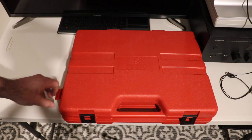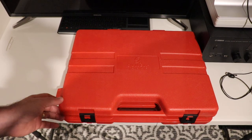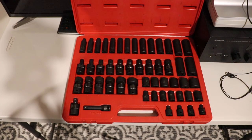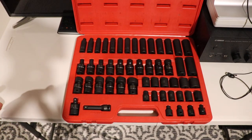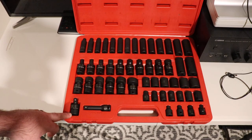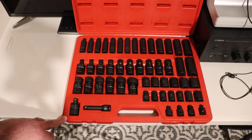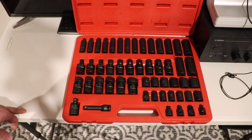I think you'll really like these. I've gotten a lot of good use out of my dual set, but I'm going to be carrying this one around more because it's got a nice wide range — 7 to 22 millimeter. It's all the same drive so you only need one ratchet; you don't need to switch back and forth between quarter, three-eighths, and half-inch ratchets. I've been using them with a heavy-duty quarter-inch impact gun and in most cases you don't need a ratchet, but with a three-eighths impact gun these would be phenomenally strong and could take off a lot of seized fasteners.